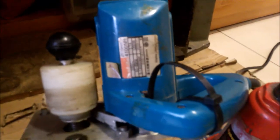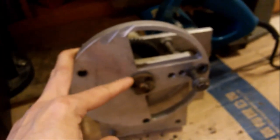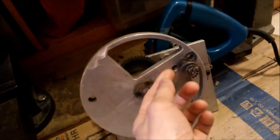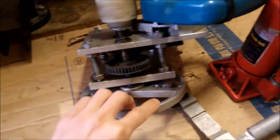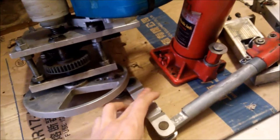Inside is a gear chain and the output shaft. The output shaft goes to this pivot point — I have different holes for testing to find the optimum one. This shaft goes through this hole, and as this arm rotates in a circle, it will move linearly — up and down.